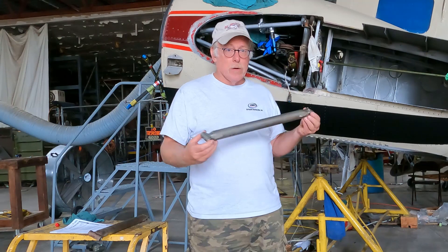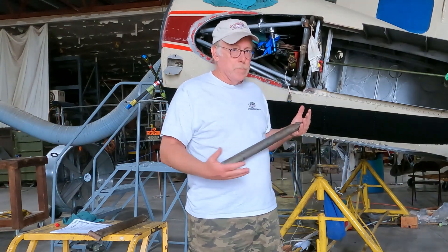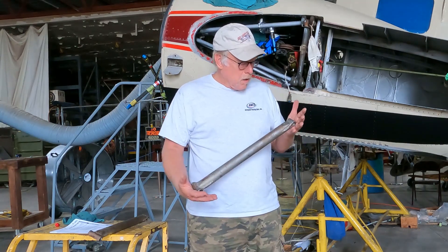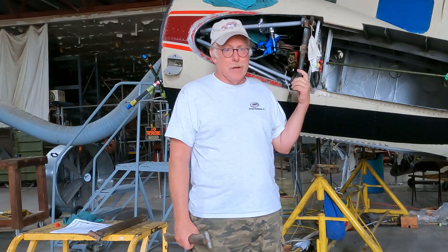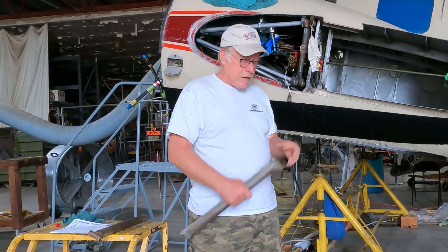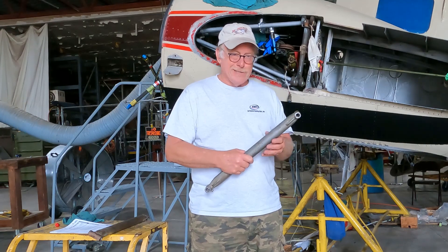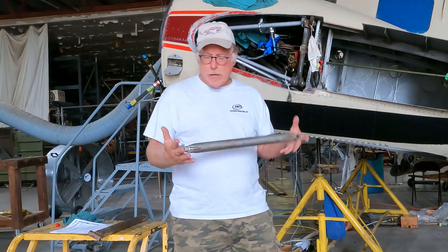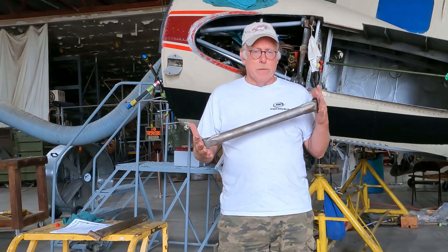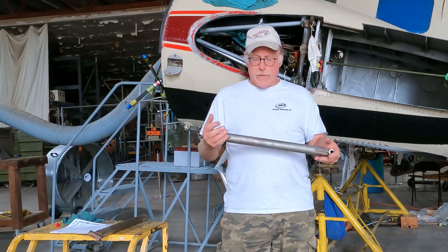This aircraft — we thought it was pretty good. It's a young aircraft relatively speaking, about 8,000 hours, a Super E, so we figured it was in pretty good shape. It's lived a pretty charmed life, spent a lot of hangar time, though it did sit out on the ramp a bit. It had a little external corrosion when we stripped the paint off — not too bad, still the original paint. Anyway, we thought these would be pretty clean, brought them to the shop for mag particle, and one of them failed with a crack.